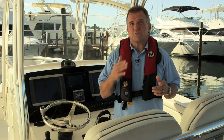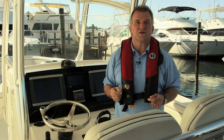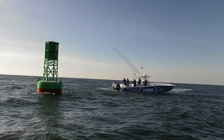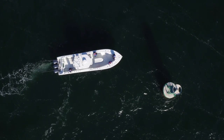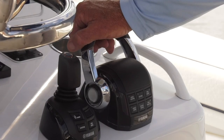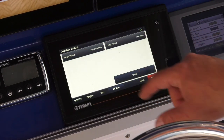Experienced captains know to point their bow or stern into the current or wind for better control. They also know that low RPM and minimal shifting is key — you don't want to make any more noise than you have to while holding over the fish. This is the perfect time for Fishpoint. Fishpoint allows you to maintain your position without using high RPM, which helps maintain quiet. Simply approach your spot quietly and put either your bow or your stern into the current or wind. When you reach it, put your throttles in neutral and select Fishpoint bow or Fishpoint stern by depressing the Setpoint button using the short or long press that you've preset.